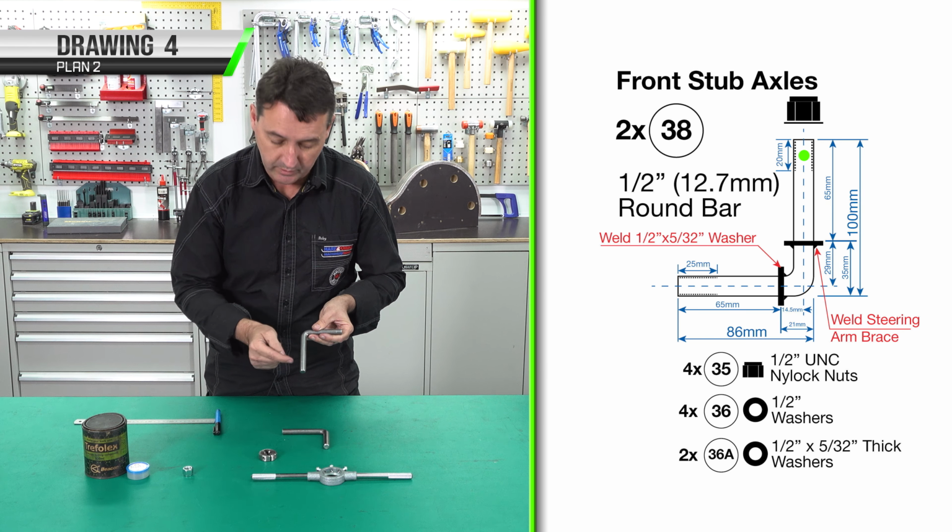The most important thing in the process of cutting a thread with a die nut and a handle is you need to apply downwards pressure evenly. Make sure everything is square, the piece should be vertical, and when you apply it, don't twist or roll. As you start it, go forward 1/2 a turn, come back 1/4 of a turn, continue that process until you get your correct thread depth. Even if you overdo your thread depth by a few millimeters, that's fine.